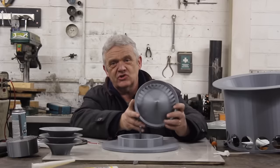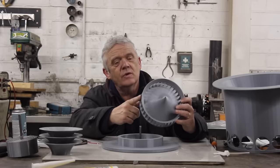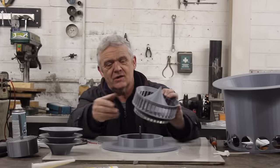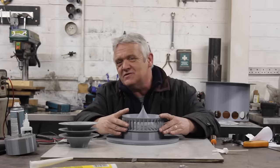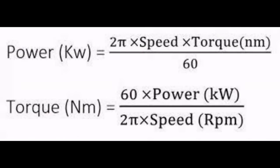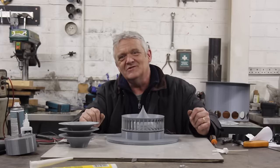What comes out of the generator as an absolute figure doesn't matter at this stage. We want to see whether voltage increases when we make changes to the wind converter — this bit that converts wind energy into rotational energy. When we're looking at the wind collection system, we don't care what volts and amps come out. We're using volts to measure the speed of the rotor, not the generator output. Because we can always bolt a commercial generator on if our generator turns out to be inadequate.